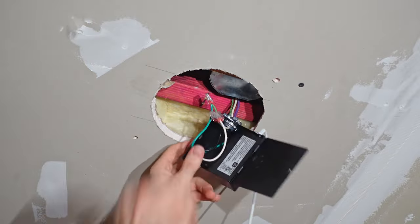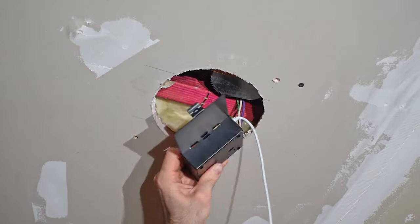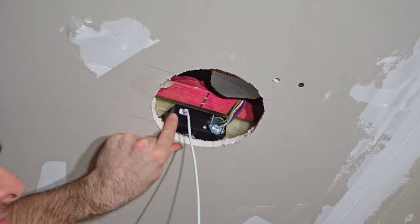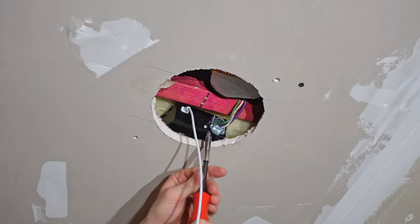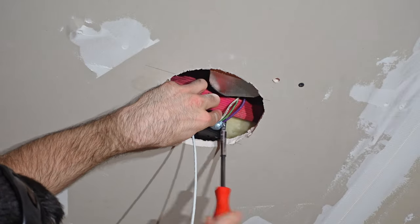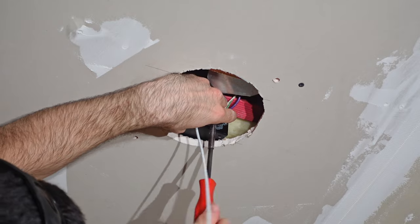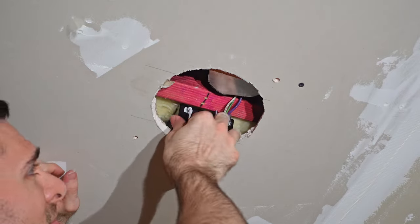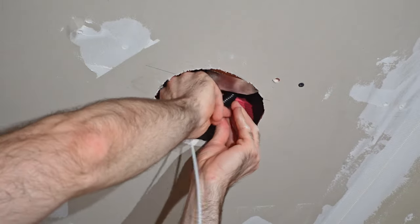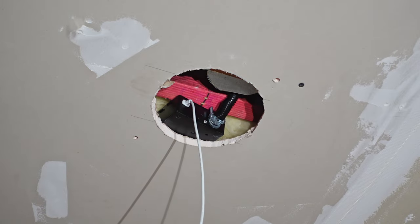Now that my wires are hooked up, the box is in the ceiling — it doesn't secure to anything, unfortunately, that's just how it was made, so it sits on top of the drywall. One important thing to point out: in the previous video, my wires were running from the old box into the new electrical box completely exposed. Here I've covered them with plastic flex tubing, which you can buy in about 10-foot strands at the store — it's made to go over wires and protect them when you don't have Romex or conduit running through.